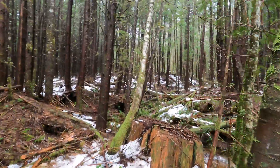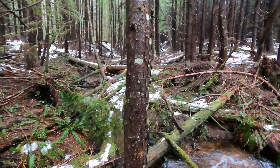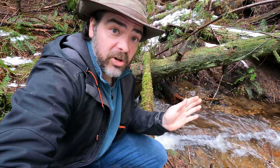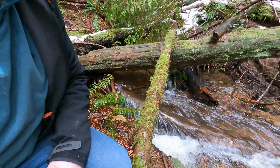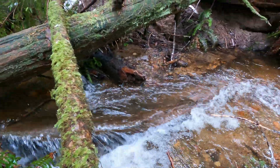Originally I thought I could maybe just put a paddle wheel right about here. The thing is, at the moment, the stream is actually moving a lot faster than it typically does. It's had quite a bit of rain, and obviously the snow melt is contributing to this runoff right now. A standard paddle wheel right here really wouldn't produce all that much power — I'd be lucky to get 10 or 15 watts out of that.